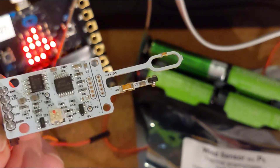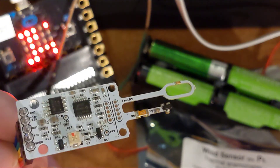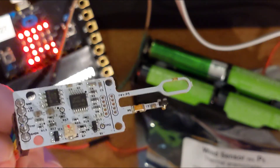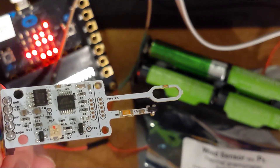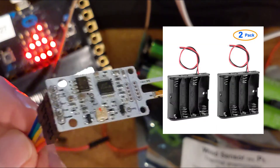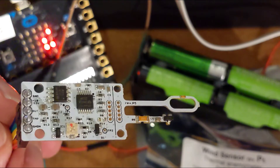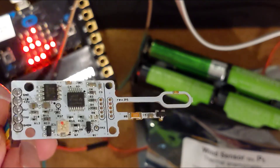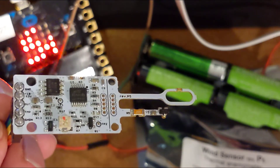The seller's website said you can use this with Arduino, but I'm actually using it with a micro:bit in more of a school context because it's an easy project to do. The only unusual requirement is that it needs a 12-volt power source. So I just stuck eight batteries together. It needs about 8 volts minimum to really work — at 12 volts it works properly. If it's low voltage, apparently it kind of flattens out.